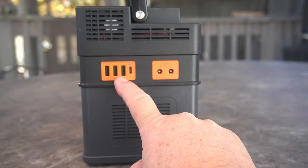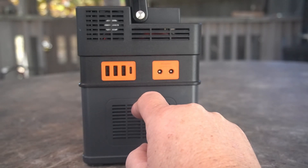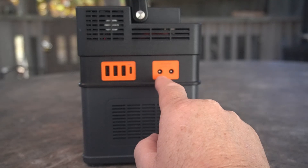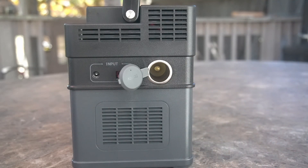On the port side: there are three USB-A ports at 5V/3A, and one USB-C port that is both input and output — 60 watts max input and 100 watts max output. There are also two 5.5×2.5mm barrel connectors at 12V/5A, and a DC cigarette-lighter socket at 12–13.6V/10A, which could run a small radio.